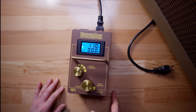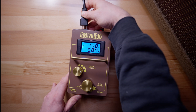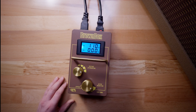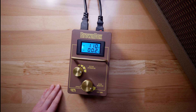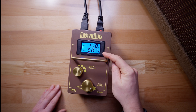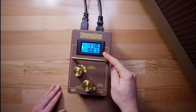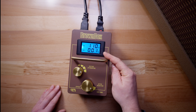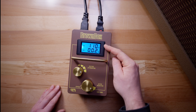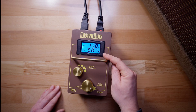So if you're getting 126 volts in, you can get all the way down to 110 volts. Now I'm going to plug the amplifier in and turn the amp on. We can see now the amp is pulling amperage — this second number here is amperage. We're not playing anything right now, it's just on, so we're pulling a small amount of amperage. We have 110 volts now going to our old amplifier.